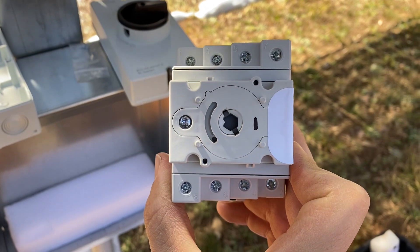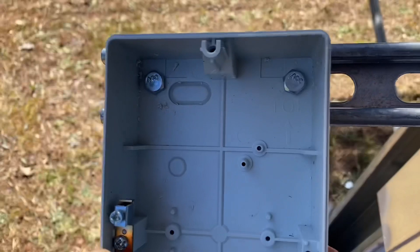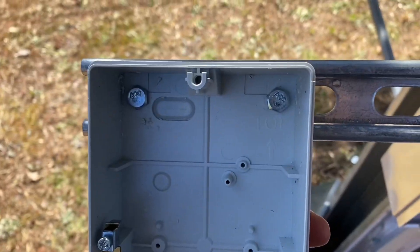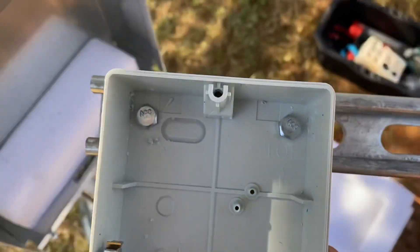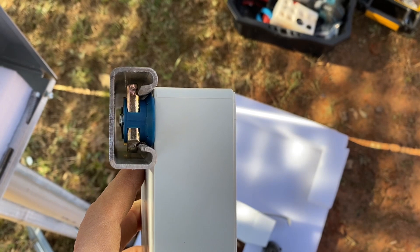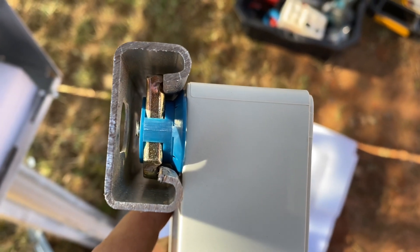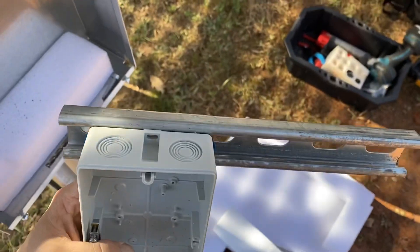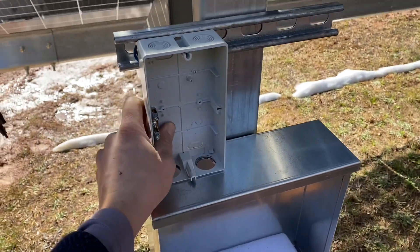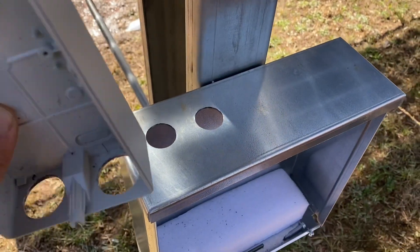The first thing I do is drill my two three-quarter-inch holes in the bottom of the box, then drill my two holes for my quarter-20 bolts and my channel nuts. You can get channel nuts at Home Depot for unistrut. I put up my piece of thin strut, put it up against there, and check where it's going to go, make my holes, make my three-quarter holes.